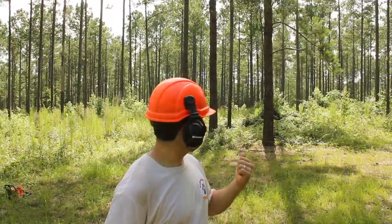So welcome back, everybody. A friend and I have got a project that we're about to embark upon. We're going to build a bed frame for our houses, and this pine tree behind me looks like a pretty good candidate for some material for those bed frames. I need about 8 4x4s that are 9 feet long, and a true dimension 4x4s. I'll probably cut them a little bit over to make it a little bit bigger so it'll be stable, so we can plane it down and sand it down to a true dimension 4x4.